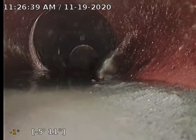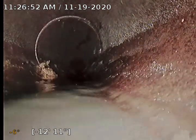So these old sewer lines, when they're installed, have a seam about every 2 feet, as a new chunk of pipe, and at those seams, over time, they start to separate, and like there, allow sand in. Yeah, none of these ones have looked too bad thus far, but I'm guessing the issue's further back.